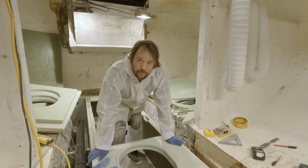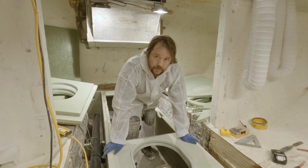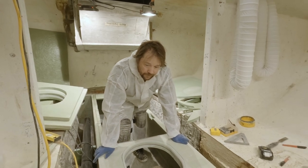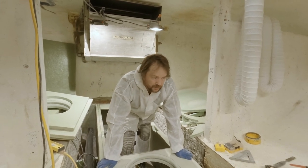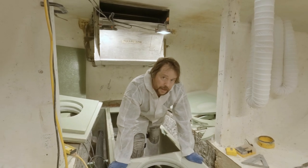Inside the shaft alley, it's always going to be a damp environment. You get salt water built up, it gets in the pores of the aluminum casting, and it starts to corrode. It just turns nasty after a while. You can't do anything about it - you can keep it clean, but that's it.